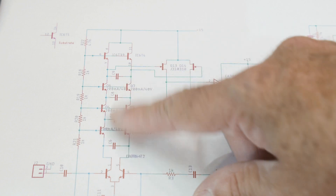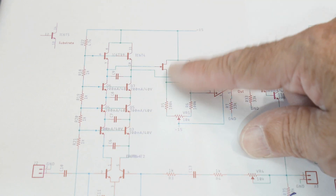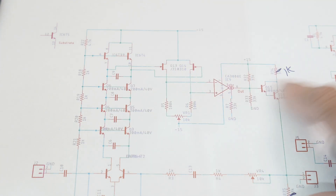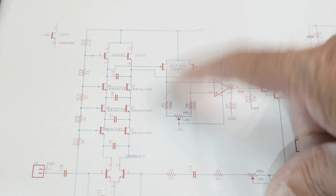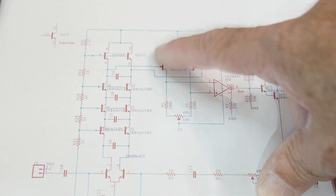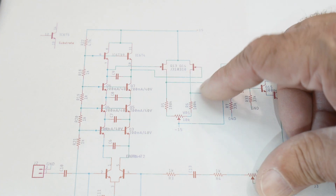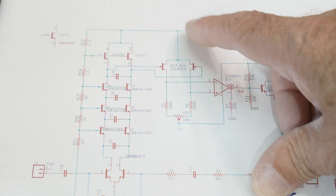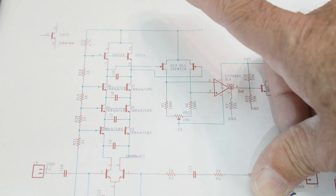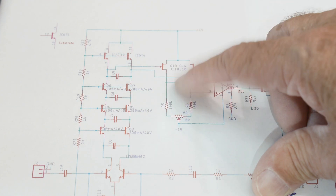I shouldn't speculate because I really don't know. The signal could get distorted in this part, or it could get distorted in this other part. The output is this amplifier here, so I'm a little bit suspicious of this. I didn't know exactly which substitute JFETs I should be using, or even if I'm supposed to be using a JFET or some other type of FET. They're n-channel, but I don't know if they're actually a JFET or some other type of n-channel FET. So I need to look into that.